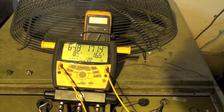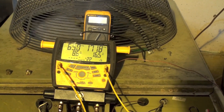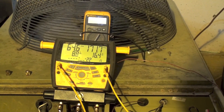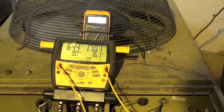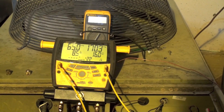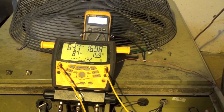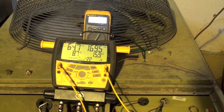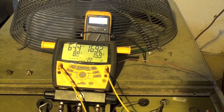I decided to put this thing in cooling mode. I've got it set up with head pressure controls because it's cold out, plus an artificial load. At the outdoor unit: about 64.5 degrees, 9 superheat, 170 on the head, and about 16 subcool. Notice the subcool changed a massive amount just from switching to air conditioning mode.